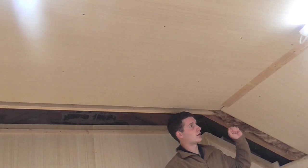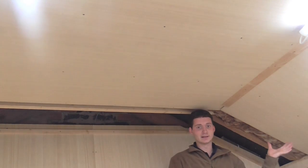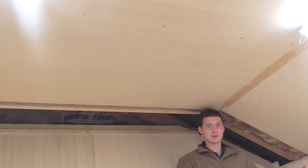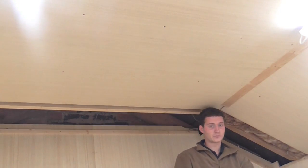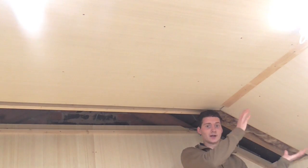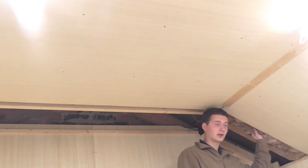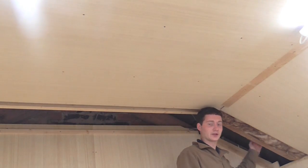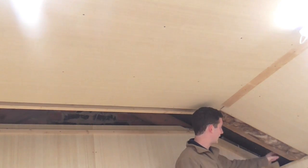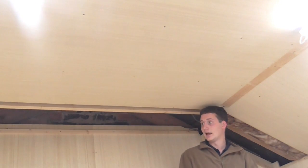With these boards rather than trying to get a really accurate cut to meet all the walls and ceilings neatly, I've just cut them short on the sides by about 10mm and then cut some strips with a circular saw that fit in the corners. That just makes life easy because I can screw the board straight up without worrying about nice fits. Insulation-wise I'm using this wool, 100mm thick, and I've got about 6 inches from here to the felt so that leaves me a ventilation gap behind the insulation. I could have used celotex but with these all being awkward and irregular shapes it would have been quite fiddly to cut it all.